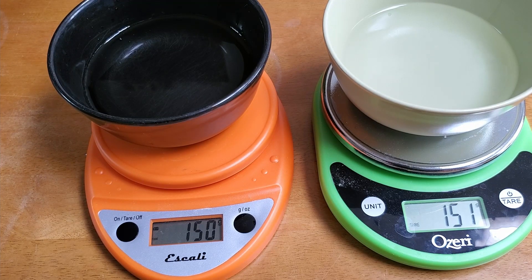It's a shame they're so slow. I think older scales actually tended to do a little better, because older scales didn't have fancy averaging of the values coming off the sensor. They just displayed more or less what the sensor was reporting. This meant the last digit tended to vary a little bit because the sensor isn't perfect — there's going to be some noise. People were bothered by that and thought it meant the scale was inaccurate. But the tradeoff is that now the scale is always showing a lower value than what's really on the scale, unless you just put a weight on there and wait. So I think that's a real bummer.